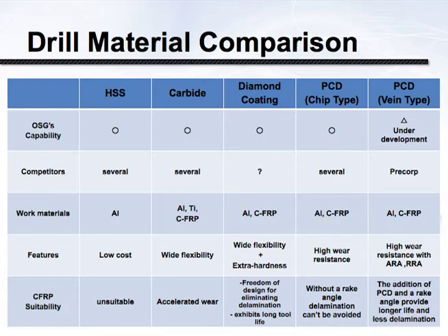Towards the top of the list we also have PCD tip drills, and there are two types. There's the wafer type, or the conventional braze tip drill — almost two-dimensional. They're used in the industry, but they do not allow for higher radial rake angles and complex shapes because of the cost associated with grinding a diamond PCD tip. It's very difficult, so the cost goes up significantly.